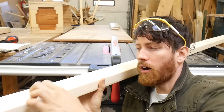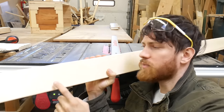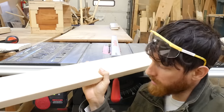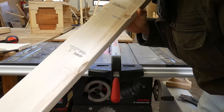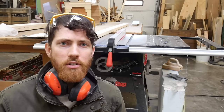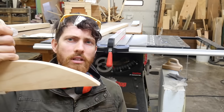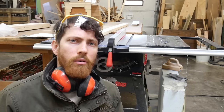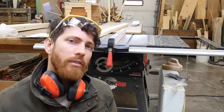Before we do this initial half-inch cut off one side, I want to mention this is an opportunity to clean up your piece of wood. This one is really almost perfect — virtually no knots, pretty tight rings — but there is a chunk out of it right here, so I can just take a half of an inch off and get rid of that entirely. We're doing this in a way that you could technically do the whole window on the table saw. The router is just going to be to make some nicer edges. When you're using the table saw, obviously follow all safety precautions: eye protection, ear protection, always have something to push through so you don't get close to the blade, and go watch a video on that if you're not familiar with it.